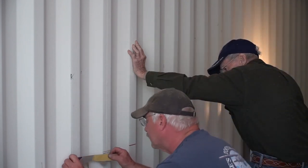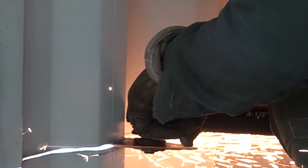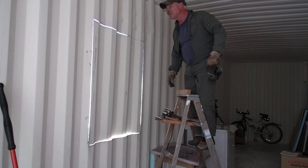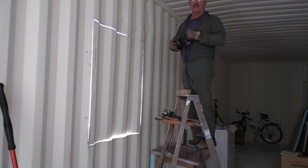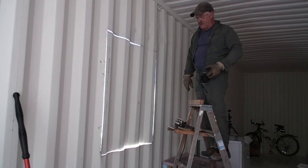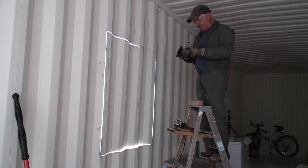Lee, the ceiling is going to be approximately 14 to 16 inches above the window here. Yeah, 15 — anywhere from 15 to 15 and a half. That's the way it's done. Why did you leave tabs on that? What's the benefit of doing that? We don't want it to fall out or pinch the blade as we get near the end, so that'll maintain our hole size until we're ready to knock it out. Now we'll just have to cut a little bit in each corner.